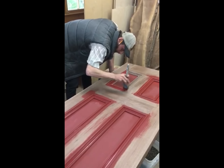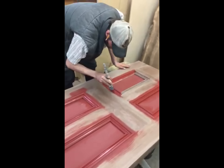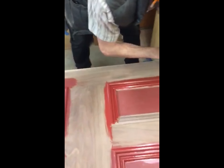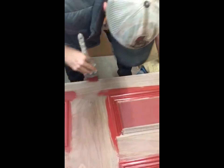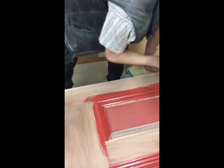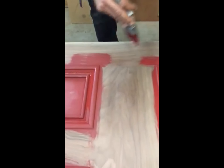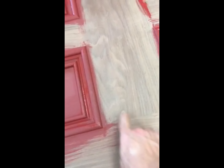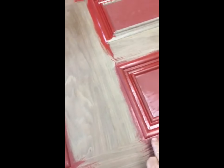All good woodworking millwork should be painted with a brush, and it should always be painted in the direction of the grain. It should never crisscross. You always need to drag it out in the direction of the grain. You would stop here and drag your line here.